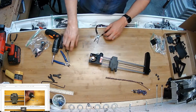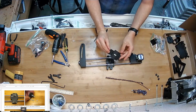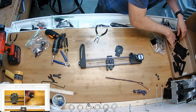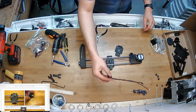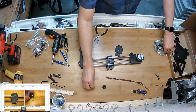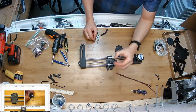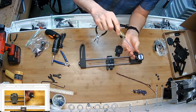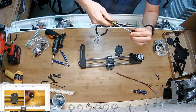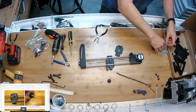Okay, now I'm going to dig out the rest of the carriage. The carriage cover piece. Dig out this nut piece. I'm going to get an 18 millimeter long screw and a 3 millimeter nut for that. Yeah, just one. And I'm going to clean out the hole. Actually, the print had a little goop in there, a little burr. That's good. I'm also going to need my magnets, which are in my hard parts bag.